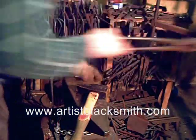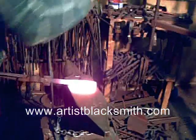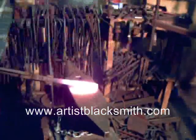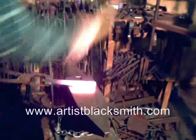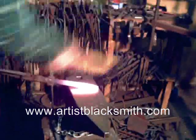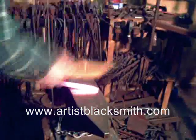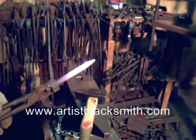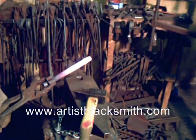The blade of a cold chisel is much like a flat screwdriver, so I'm making it an even taper in one direction, but keeping the edges parallel with the original bar and essentially wedging out the tip. It's not a complicated forging process at all. You can see I'm bringing the hammer down at an angle, and I'm also lifting up the back end of the chisel. I'm sure many of you have made chisels before — not that complicated.